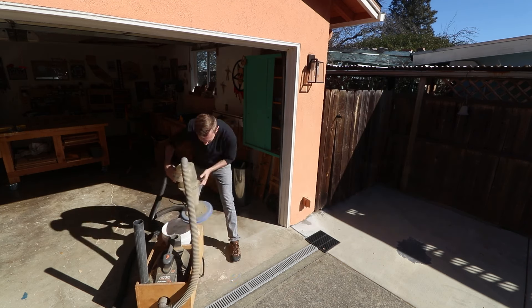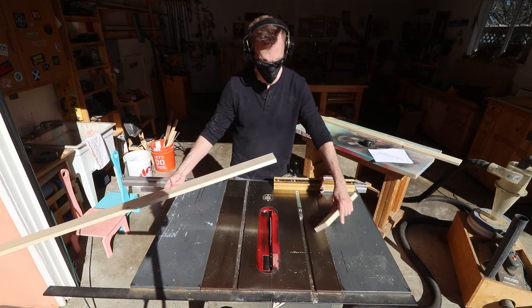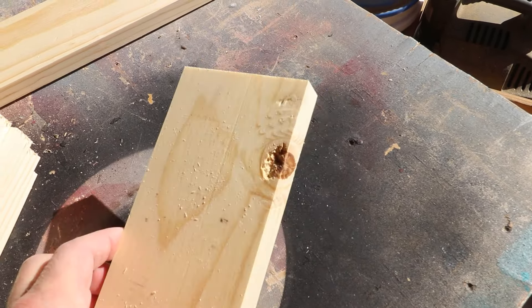I like working out in the sunlight when I can, mostly for the rough cutting part of the job. When I get into finer details I like to move inside. I've got a stop block on my miter gauge so I can cut equal length pieces for the legs and stretchers. For this project I made really detailed plans — if you'd like a copy, I'll include a link in the description where you can download those for free. As I was cutting, one of the leg pieces had a bad knot right where the half lap joints go, so I just cut another piece. It's always good to have a little extra to run tests.